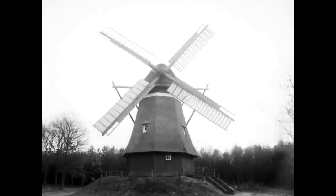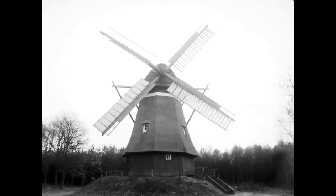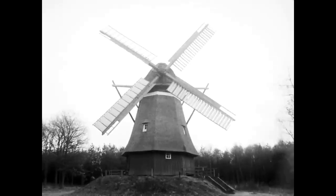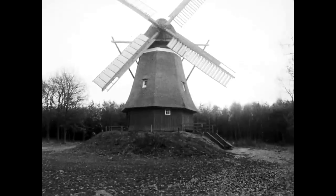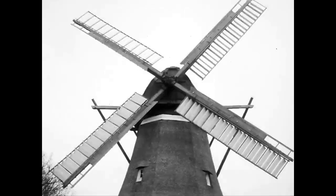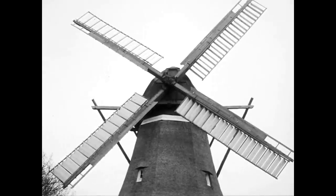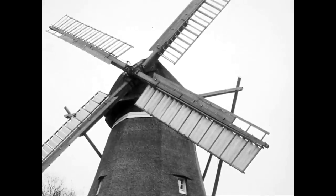This windmill is located in the Rheinische Open Air Museum in Kommern. When it received a new crossblade, the millwright's work was captured on film. The four blades are attached to two massive oak beams. On the mill roof, the cap and wings are inserted crosswise into the head of the mill axle.